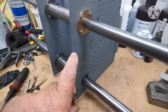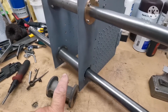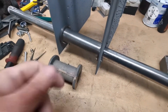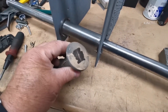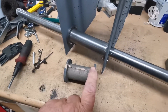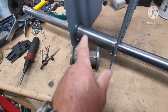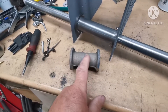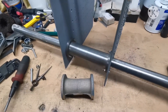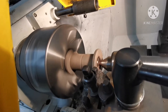Right, today I'm going to do the bearings for my axle. I'll just take this tube out so I can face off that end in the lathe, ring that off, turn it round, do the same on this end, then chop it in half and finish machining this size to fit inside the tube. I'm just starting to face this end off.